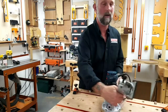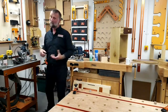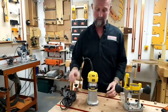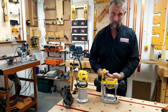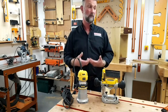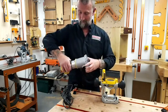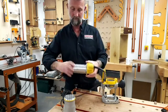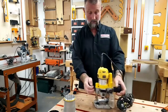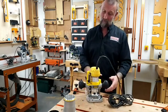If you need a little bit more power — say for a dovetail jig — DeWalt have a similar combination setup at 900 watts with variable speed, which is useful because with 900 watts and bigger cutters you need to slow the speed down. We use this one a lot in the skill centre, just like the Bosch. It's a fine adjuster when you've got it in the fixed base. It feels great in the hand — that equal-handle traditional style I'm used to. So that combination gives you the best of both.